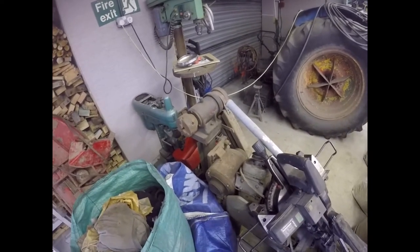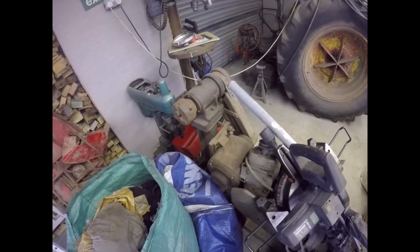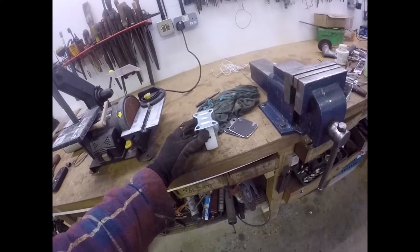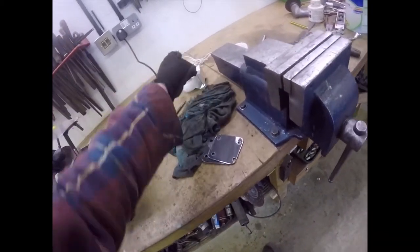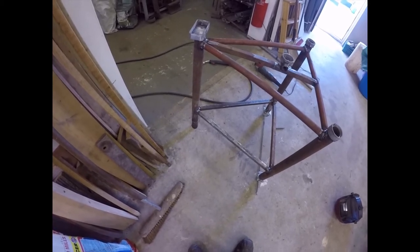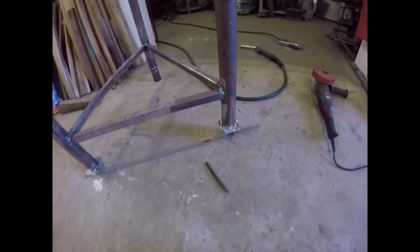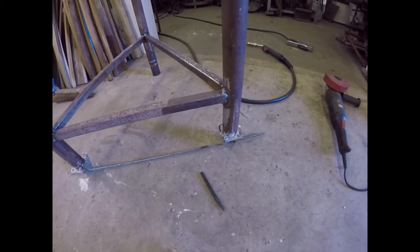That was a bit of stuff turfed out at somebody's workshop and given to me - it was a matter of deal and I got it. These casters are going to have to be welded on in a straight line in relation to each other so that they don't crab when you push them forward. There must be a trick to doing that but I don't actually know what it is. I've added the required length to the third leg - the height of the caster plus the thickness of the plate. I've done the obvious and just put a long axle through both caster pivot points which should get me square enough, and I'm ready to tack it on.